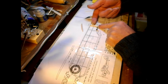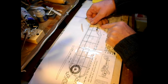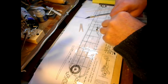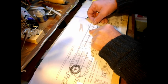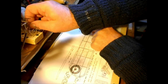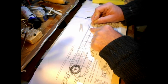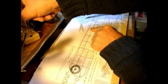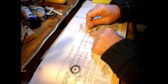Partly because I want to match it with the root of the neighbouring wing that's going to attach there. So to know exactly where that's going to go requires that spar to be in the right place. That's extra long, so I can put pins in each end and the parts of the spar that are going to eventually get cut off when they get trimmed to length. I'm not weakening the actual structural part of the wing.